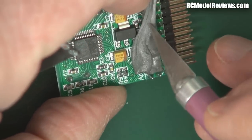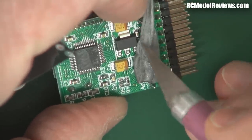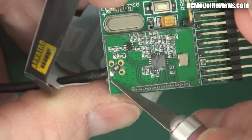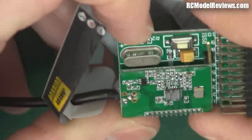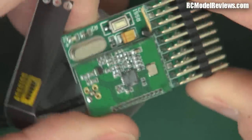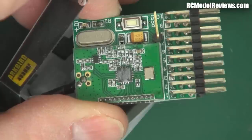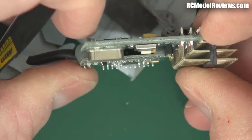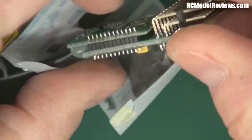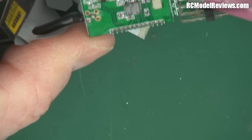Apart from all that, the board construction looks reasonably good — there's a three-terminal regulator, probably an LM317 or similar. There's adhesive holding the plastic case on, and that receiver antenna — why didn't they just use a UFL connector? There's a footprint for a UFL on there; they could have used it but instead ran this horrible cable. You could unsolder it and put your own cable on there. I'm going to test it and see how it works — who knows, this could be the best thing since sliced bread. But the physical construction is satisfactory; it doesn't spin my wheels. Honestly, the main gripe apart from the old-school crystal is the scraped markings.